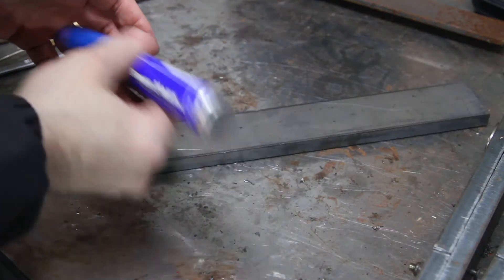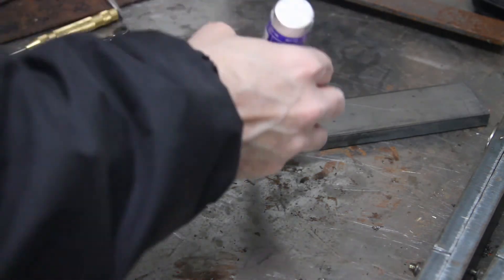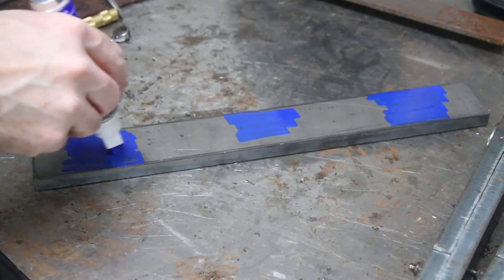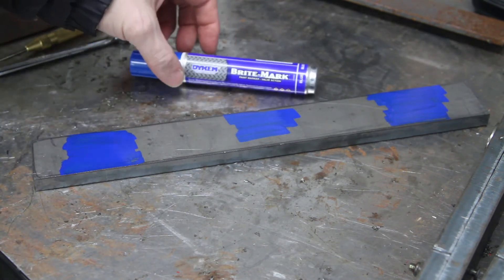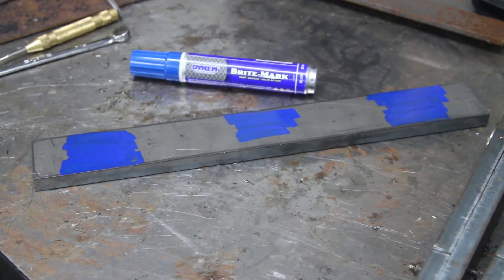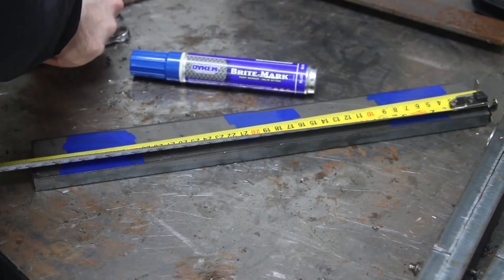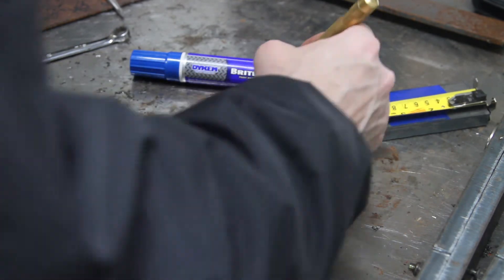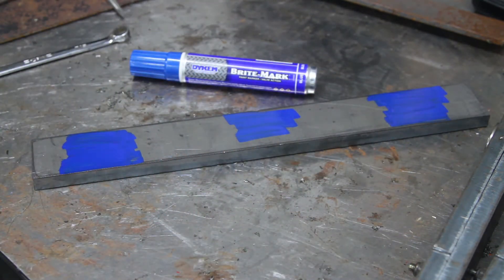So on to what I have decided to do. This is half-inch cold rolled steel — cold rolled is stronger than hot rolled. I'm putting the layout die on it and I'm going to lay out the position for the holes, center punch, center drill, and then use progressively larger size drill bits. Through careful measuring, I found that the axles are 30 centimeters on center. It was really difficult to come to that conclusion — I had first measured 29.5 centimeters — but I tried 30 centimeters, test fit it, and confirmed it. So 30 centimeters is what we're laying out here.